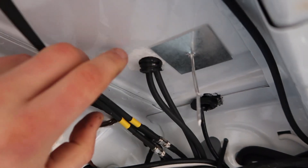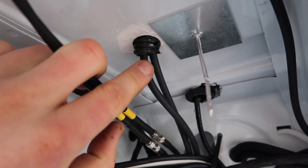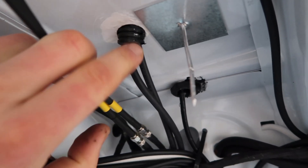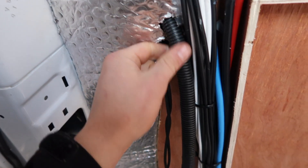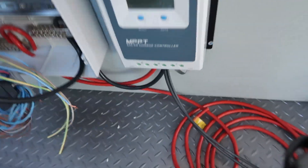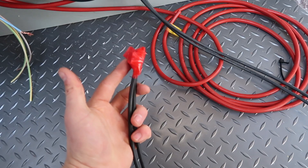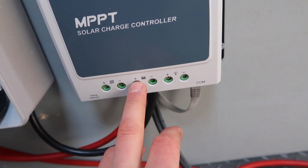The solar panels are on the roof. The cable gland is up on the roof from the MC4 connectors, with a bit of plastic to stop the wires chafing on the steelwork. The positive and negative cables run down through the sheet metal at the back, kept in plastic conduit, through the bottom, and come out at the back. This positive and negative will be attached to the MPPT solar controller, connected to the positive and negative terminals for the solar panel input.